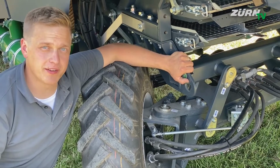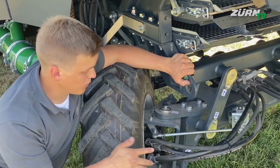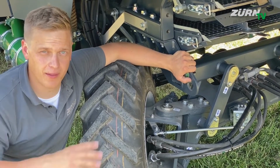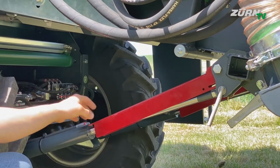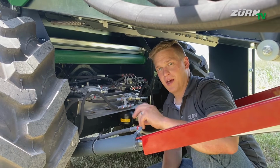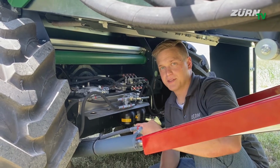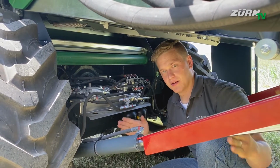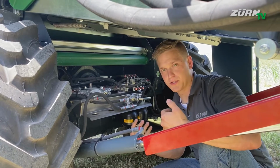This machine here is equipped with a fully integrated John Deere Auto Track system. That's why we have this steering wheel angle sensor at the rear axle. The robust front axle has one central driving motor with a fully mechanical diff lock, and the wheels have an outside track width of 1.75 or 2 meters when you turn them around.